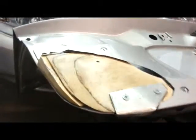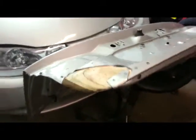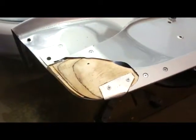So, I added an aluminum piece right around here because these things here wrap around the metal part of the trunk lid. And I just wanted to strengthen it up, so having aluminum there, that's nice. And of course, in my usual tradition, it's both glued and screwed. And this is probably the last time that we're going to see this before it gets covered with Bondo. So, here comes the fun part.